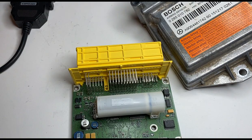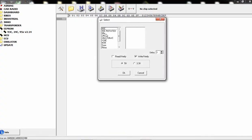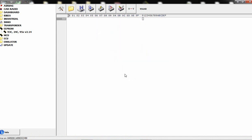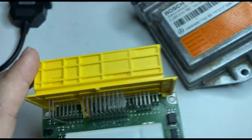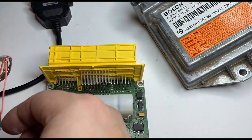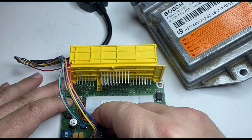Just go to my CarProg, set up my EEPROM to 95640. We want to read and verify. We want to make sure it's a good read. And you can double check over here, 95640. Pin number one is right here. So we are going to, on the original one, set my EEPROM clip